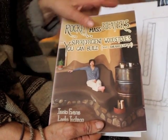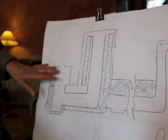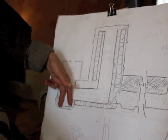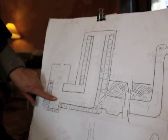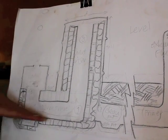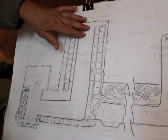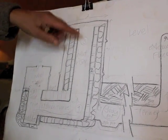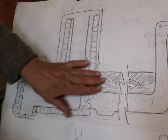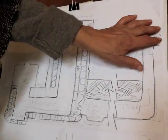We'll show some examples and how to put together the combustion chamber. This is a side-view diagram of the combustion chamber. Essentially, there's a 15-gallon steel barrel that the wood goes down into. It's actually called a downdraft stove because the fire goes downward. The air comes down into it, and then there's a chimney made out of brick called a heat riser — an internal chimney driving the whole system. The gases come down the inside of a 50-gallon barrel and are collected and sculpted with earth into an 8-inch pipe. This is a drawing for an 8-inch system.